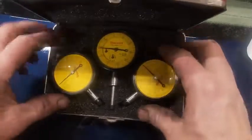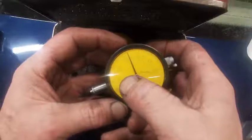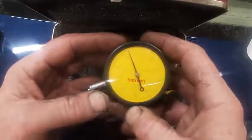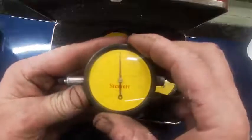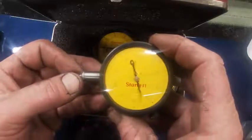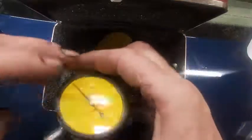So that's the smallest one. If you look at this one, it's got a .01 millimeter increment, so each mark on the scale is worth .01 millimeters. This says it has a 2.5 millimeter range, so if I zero this, this should go around two and a half times when I push the plunger. I'm pushing it — there's 1, 2, almost 3, not quite. So that's how that one works.